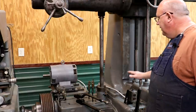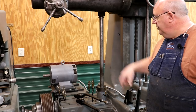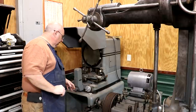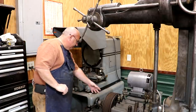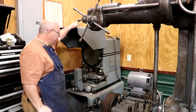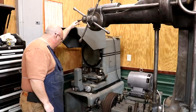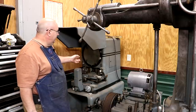What I want to do now is get over here and see if my belt fits — get the pulley on the motor and see if we can get this thing wound up. I've got kind of tight quarters back here. I need to pull this yoke off the end of the motor — this is basically the clutch that turns it on and off — so that we can get the belt on. I've got this big old optical comparator that's in my way. I was going to try to work around it, but I think I'm going to have to just pull it out.